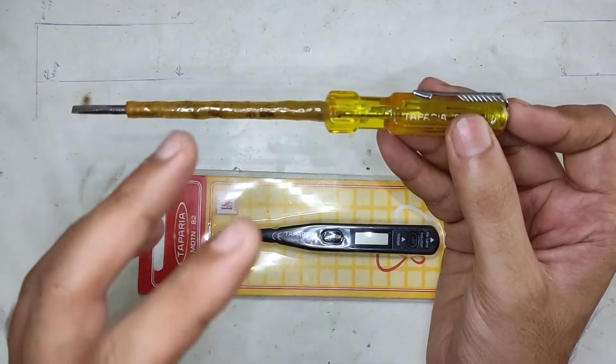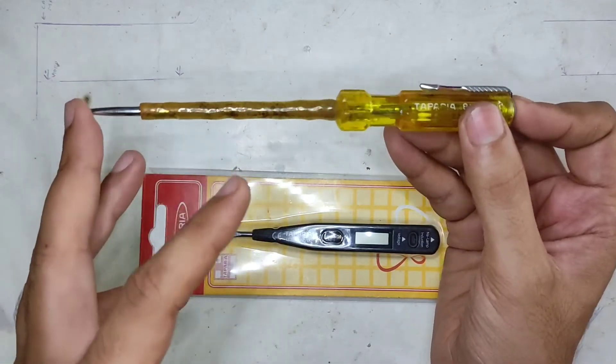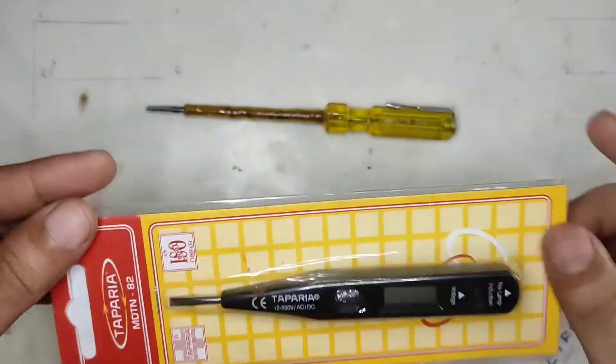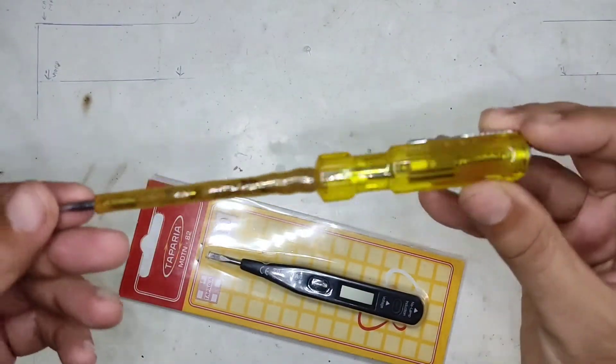This is actually making use of your body itself as one of its conductors. Because of that, a lot of people are concerned since you are putting your life at risk by probing directly onto AC mains with just a resistor in series. And this digital line tester is the modern day alternative — though this one can only measure AC as it's a neon bulb based device.